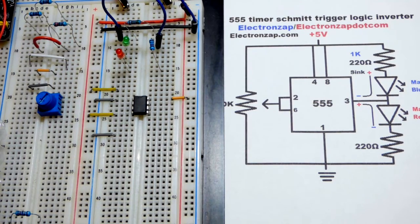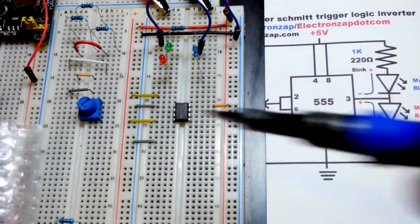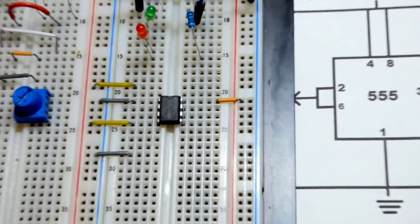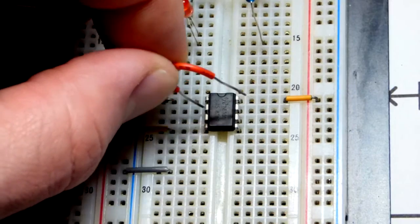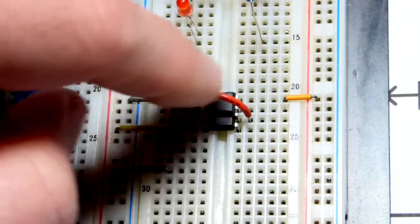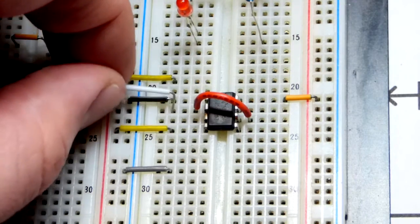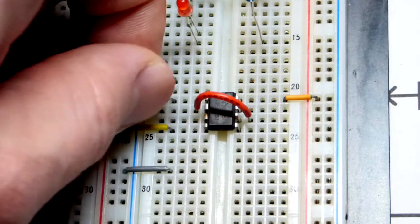When it comes to the trim pot, we're going to use it for a signal. So the trim pot connects to pins 2 and 6. The trigger is pin 2 and the threshold is pin 6, so they'll both be monitoring the voltage. The middle of the trim pot connects straight across. The trim pot has three little wire pins: the two on the far sides are the ends of a resistive element, and the middle one is attached to a wiper that slides depending on where you turn the trim pot. We need to get power on the two sides — more positive up top and more negative on the other side.